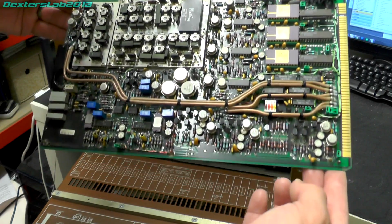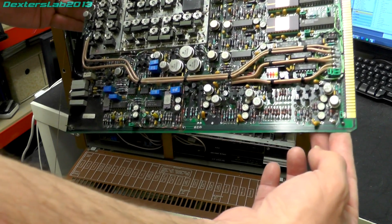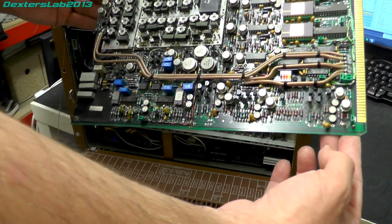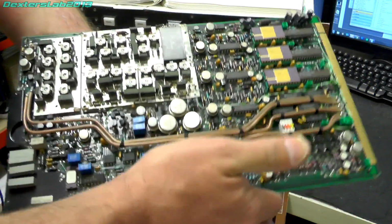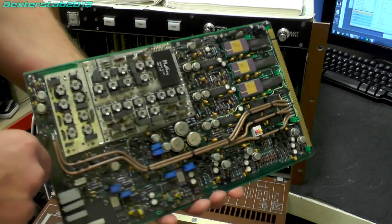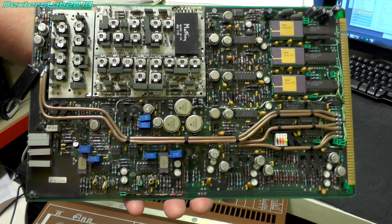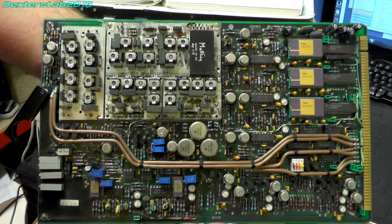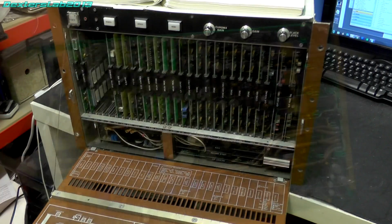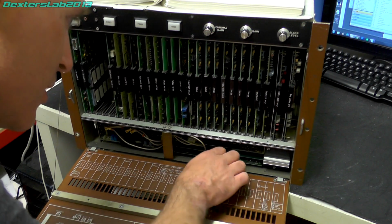Let's see what the description says. Introduction: this takes the YUV picture data and converts it into 2 sets of coded and RGB analog video. So yeah, it converts the digital data into analog video. So you'd have 2 types of output. One is the RGB and YUV outputs, and the second would be a composite PAL output signal as well. Right, so if we delve down into the bottom, I'm actually doing these in the order that they appear in the service manual.